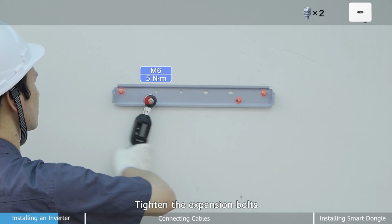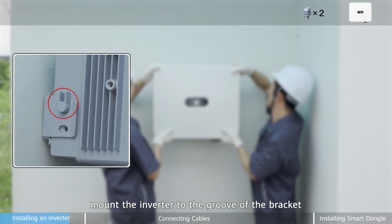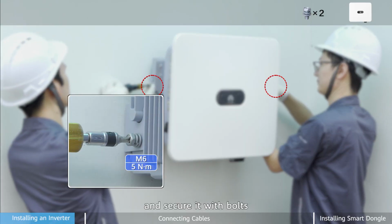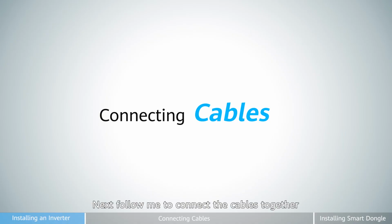Tighten the expansion bolts. Mount the inverter to the groove of the bracket and secure it with bolts. Now we have completed the installation. Next, follow me to connect the cables together.